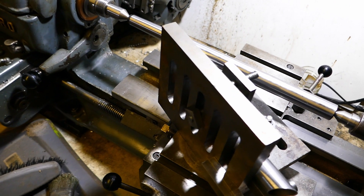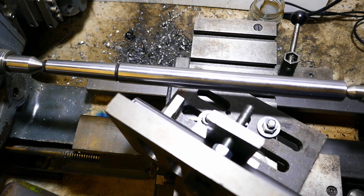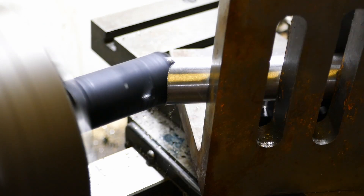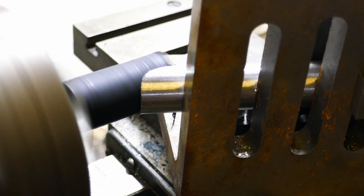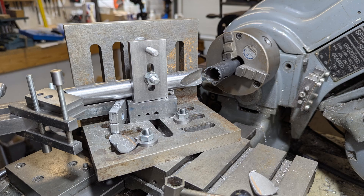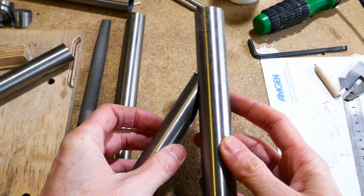This is the setup on the lathe, which I used to notch some of the longer tubes. This is what it looks like from the back. I made a wooden jig to assemble the parts for the top tilting arm and used this for tack welding the parts together.